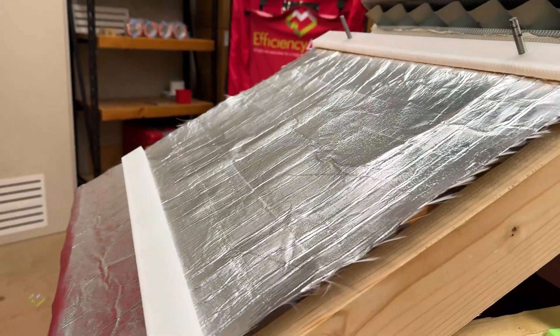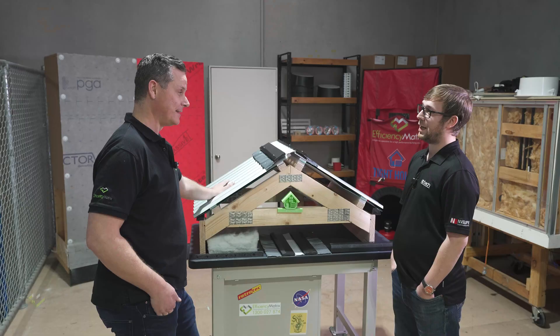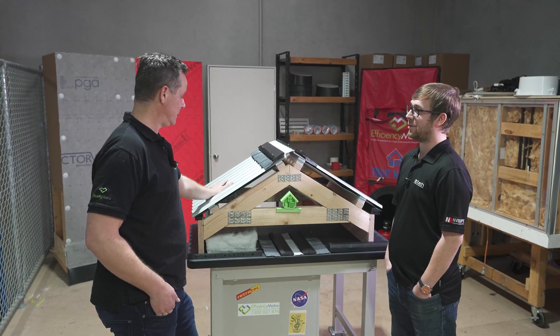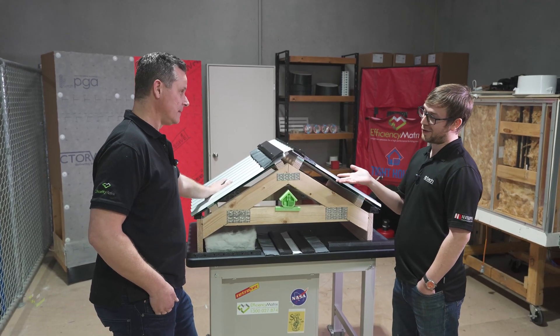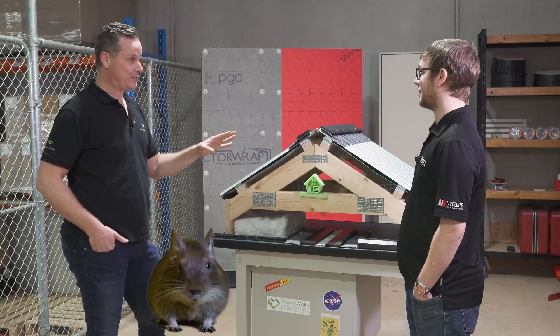It's been tested to very high fire resistance, is still fully vapour permeable — which is exactly what we want from a sarking on the outside — and it's completely airtight too. To be honest, when it comes to fire it wouldn't be any good if it wasn't airtight.